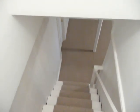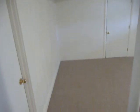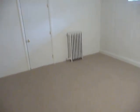This is probably the biggest before and after video of the whole house, other than the kitchen. It's really amazing what you can do to a home. But we made everything down here one color, a nice flat white, like I suggested. You can see the plaster repairs have been taken care of here, as well as over here. I shored up all the ceilings. We had a big issue over here that everything was hanging down. We've shored all that with the proper washers.